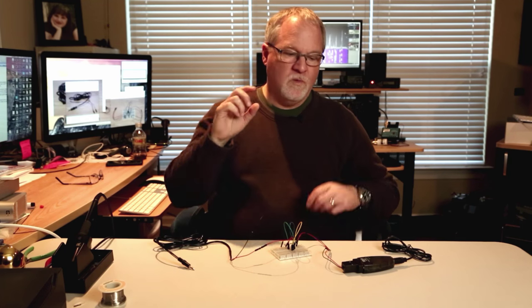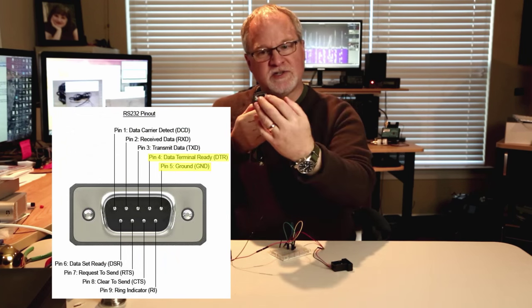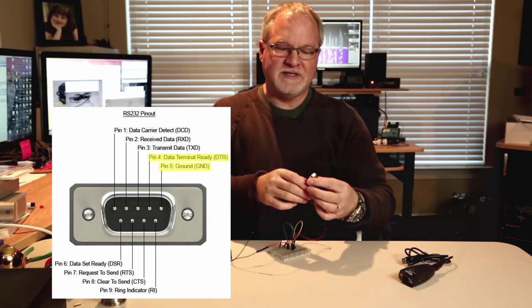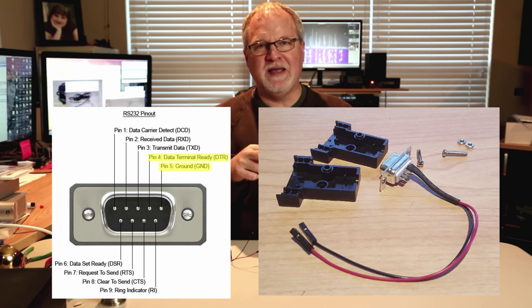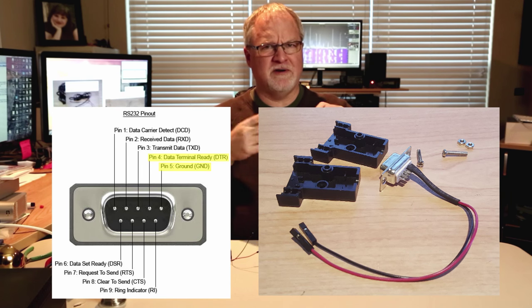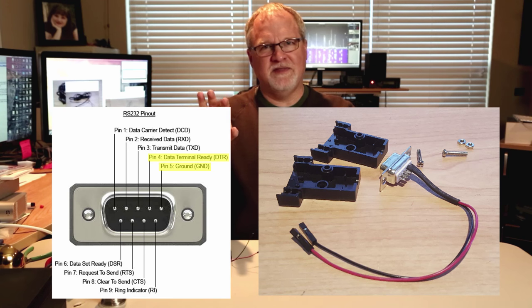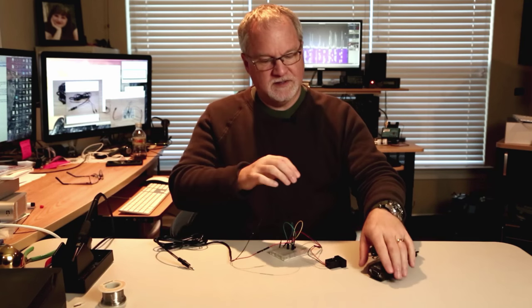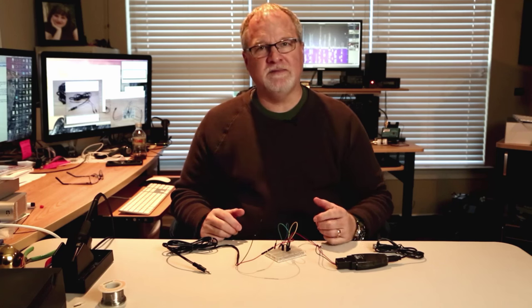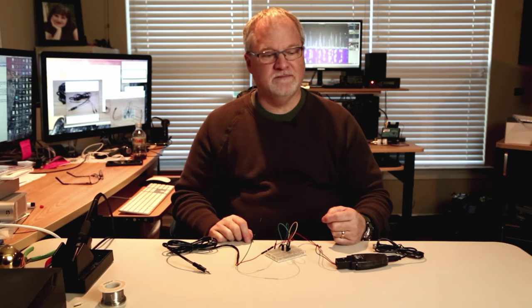And by the way, before we do that — when you're soldering this stuff, the pinouts of a DB9 are shown to you as though you're looking straight at the male connector. When you go to solder wires, it can be a little confusing because you're actually working at the opposite side. Since this female plugs into the male, the two pins that you're soldering to aren't necessarily the same two pins you think they are. They do have to go straight through, so it's kind of a mirror image and it can be confusing. So if you're looking at that pinout diagram and looking at the picture of the shell where I soldered it, those pins don't look like they would match, but they do once you put them together. Having said that, now we've got something that we can test. Let's go to Scott Davis's software and look at his CW transmit setup and I'll show you how it's configured and then we'll test it.